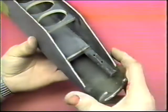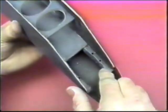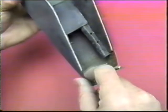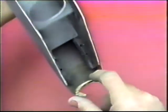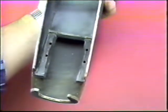That seam is looking pretty good now. I can't even tell you how rigid this is. What I'm going to do is remove some of this motor mount material in here where the motor mount pad actually ends — this material is just going along for the ride, and I'm trying to clean up this nose section. Going to have to add some thickness in here, maybe not — really can't tell. This worked out relatively well. I like the reinforcement around the nose ring. Up here it's kind of pointless to try to save weight — there are just too many other easier ways to do it.